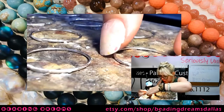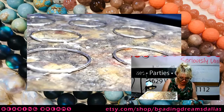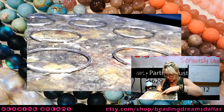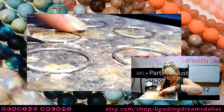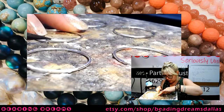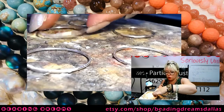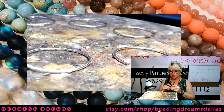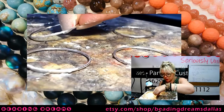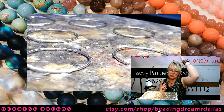This is one of those, you know, prep work is no fun. Nobody likes placing solder. Nobody likes filing. The fun is when you see the thing coming together, and all of these preliminary steps aren't necessarily the most gratifying. But I will tell you that if you do a good job of prepping, your soldering is going to go so much easier. The chances that you are going to create some kind of critical error, or melt something that you don't want to melt, is significantly lessened by prep work that is done properly and meticulously.